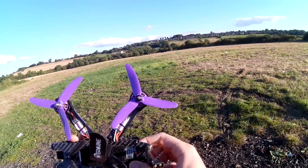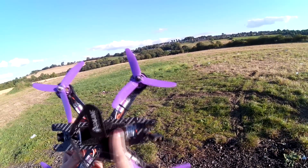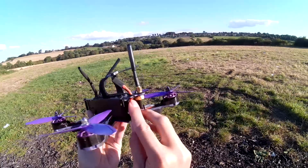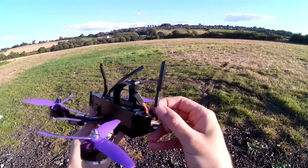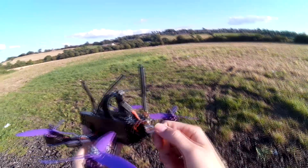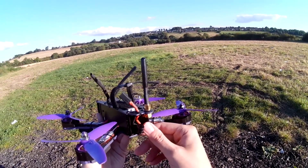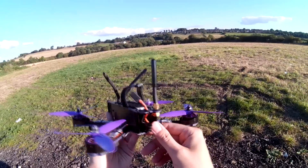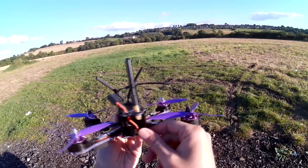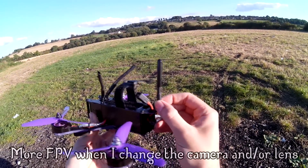The VTX I stuck down with some double-sided foam as well - it was just basically hanging there moving around with a cable tie over this part, so now it's a bit more solid. This right-angled adapter here likes to pop off; I physically just pressed it back together with some pliers and it clips in relatively tight - as tight as it was when I first got it. I wouldn't expect it to last that long in crashes, and you might have a problem if it comes out and you can't find your quad. But the VTX might stay alive 10 minutes or so with the right-angled adapter on it - it's got something on at least.